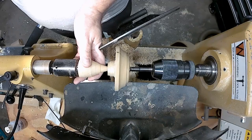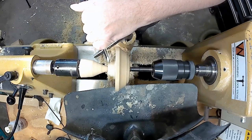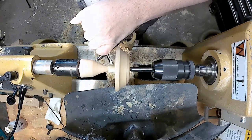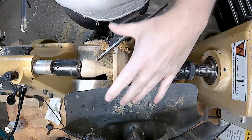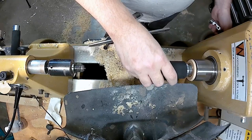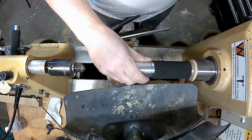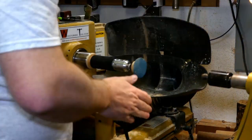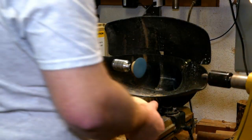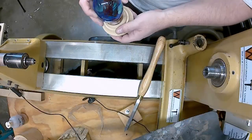Here I'm reverse mounting — I'm actually using the original 5/8 Forstner bit as a drive center, and then I've got a wooden cone to stick in the back and start cutting away that final small tenon. You can see it just snaps off — no big deal, we're going to be sanding the bottom anyway. I've got a spindle adapter that changes my big threads to small threads, one by eight. I put on a four-inch foam-grip handle and a quarter-inch adapter — this is the modular handle tool system. I take my sanding mandrel and lock it into place on my tool handle, which is now mounted to my lathe spindle, giving me a perfect sanding platform. I go from 80 grit up to 320 on the bottom.